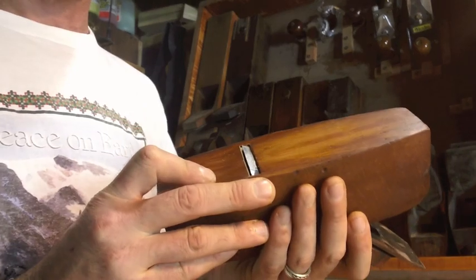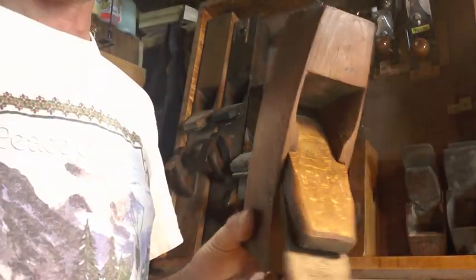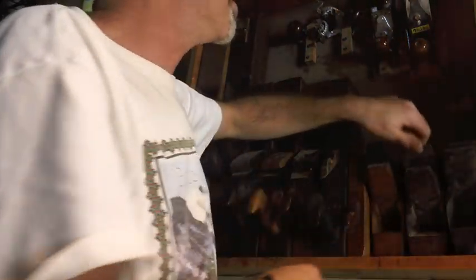Good old coffin smoother — these are my favorites, and they do just as good as a number 4. The only difference is setting the cut is a little harder because you have to move it with a hammer. I chose wooden planes mainly because I like the time period, I like the way they work, and I like the metal — there's something in the way the steel and iron are put together instead of just being one chunk of O1 or A2 that you sharpen. There's wisdom in the old methods; there's a reason why samurai swords and Japanese chisels are two pieces of metal put together, and why they cost what they do.